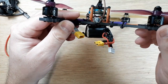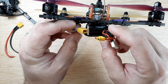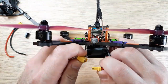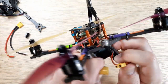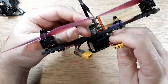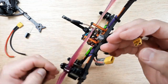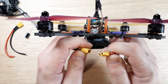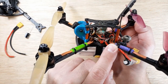The balance lead is pointing toward the ground or away from the props. Not only does orientation match up nicely so you're not turning and twisting and fraying your wires, but look at how I'm plugging this in — I can hold my battery pack and plug it in. What happens if this quadcopter takes off when I plug it in? I don't understand why people put their pigtails where they have to go through the prop line. I like to stay away from the prop line, plug it in, I can unplug it real quick and I've got control of it.